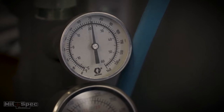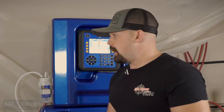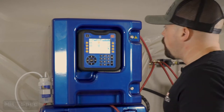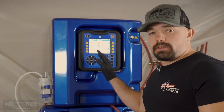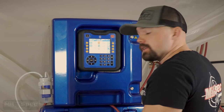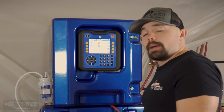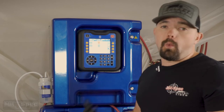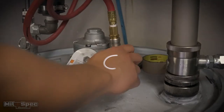We traditionally spray BL1 material at 155 degrees. We're gonna go ahead and let this heat up to 155 degrees while we start working on our truck or whatever our project is for the day. The whole time this is heating up, the agitator is mixing. When this finally gets up to 155 degrees, that means the resin barrel has mixed long enough, and at that point we can shut that down and start our warming-up process.